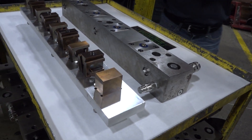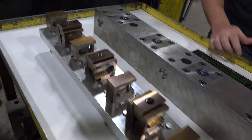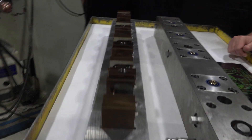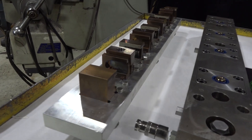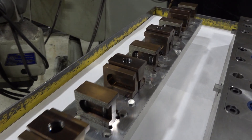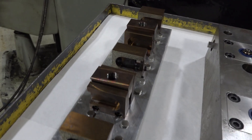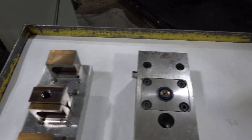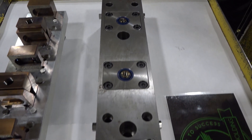It is. We've done a lot of testing for our clamp force, and one of the problems that we came up with is the management inside a pallet pool of the right gripping force and consistency. By the time you add hydraulic hoses and all that stuff, it got too complicated, too expensive to manage, too expensive to purchase. So we spent a lot of time in conjunction with HDM hydraulics in developing a workholding system that could just clamp and hold for as long as we needed it to hold without a degradation in clamp force.